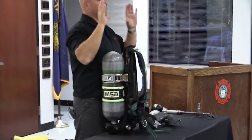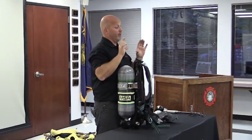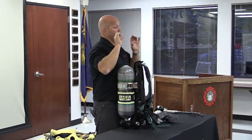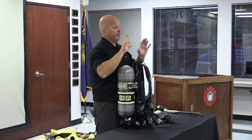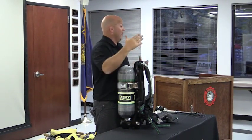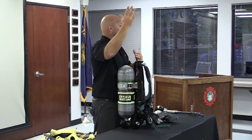NFPA has now dictated what the full alarm sound has to be, as well as its sound pattern, what it sounds like, as well as its decibel level. We can make it louder, as you can tell. Our pre-alarm isn't regulated, so you can tell we made that even louder.